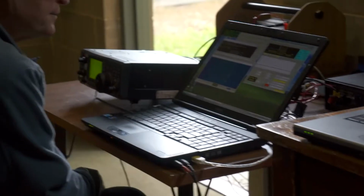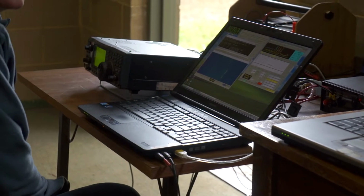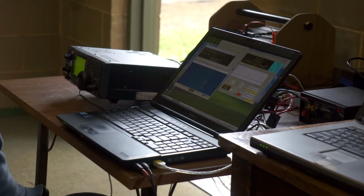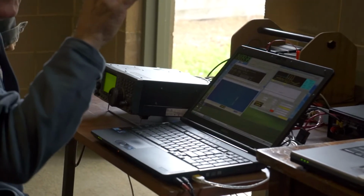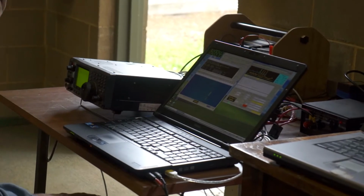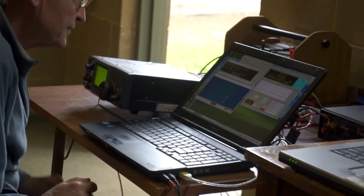That's exactly what he's doing. What's your best angle? Is it better as you get higher, Rex? Not much, it depends on the distance. At 24 gigs it matters, because you get much less absorption through the water vapor at higher angles. What about noise-wise? The beam is so narrow that once you get above the trees, you're clear of them.